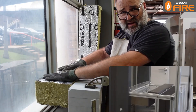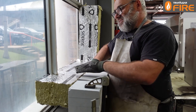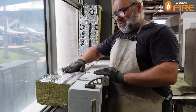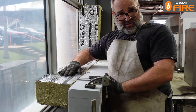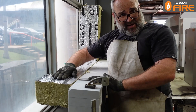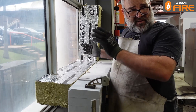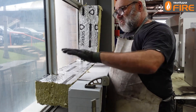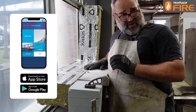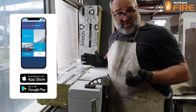That's very important because in a fire we want the material to be there. Certifiers are telling us they love the fact that all the components are supplied by Trafalgar and Siderise — the mounting angles, the pre-laminated engineered factory-made board with identification, the mounting tape, and the tape for the joints for the smoke seal. Best of all, there's an app: download the free app, take photos as you go, and you get a warranty and certification from Siderise globally, free of charge. I think it's fantastic.